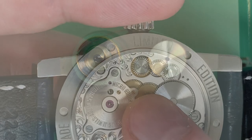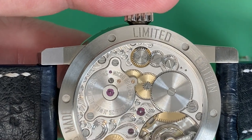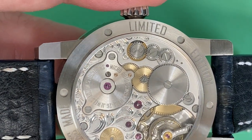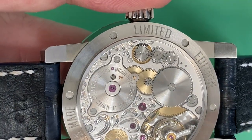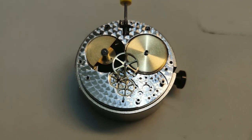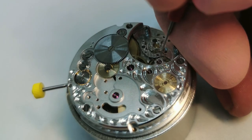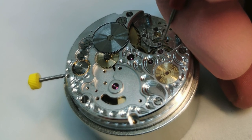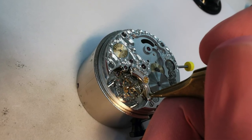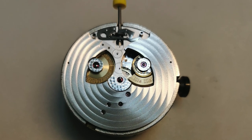Now, I thought maybe someone had either tried to replace them with some other sort of brass bushing, or that the jewels had been removed, but these are actually copper beryllium, which is what they used. So they transitioned from using jewels initially, but after a little bit of time they realized that's not going to work as well, and they transitioned to copper beryllium bushings for the micro rotor gear train. The reason why is because of the pressure on the jewels. You can put too much pressure on a jewel, and they're awful tiny, and yes, they're strong stone, but they can crack, they can chip. Because of that pressure on the jewels, they decided that, because of the diameter of the axis, copper beryllium is so strong that they would put copper beryllium bushings in the rotor gear train instead.